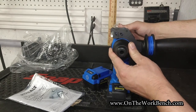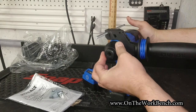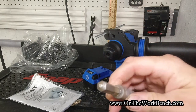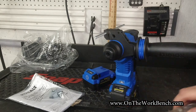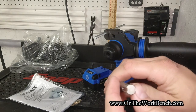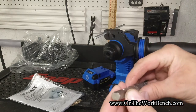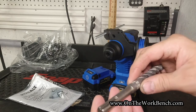Looking at the front of the tool, you can push the collet back to insert your bit. This is not rated to be used with a hex shank bit — this is an SDS Plus, which is intended specifically for SDS Plus rated bits. You'll see it very clearly on the packaging. The main supplier of these is generally Bosch, which complements their Bulldog line.